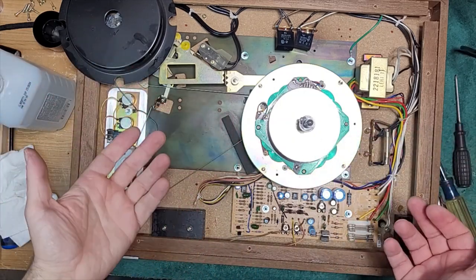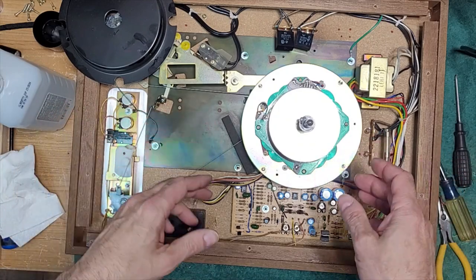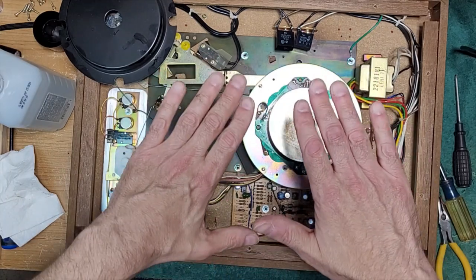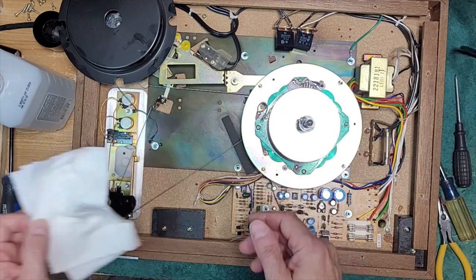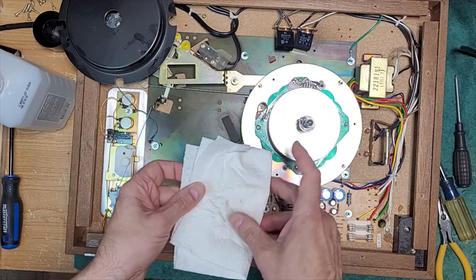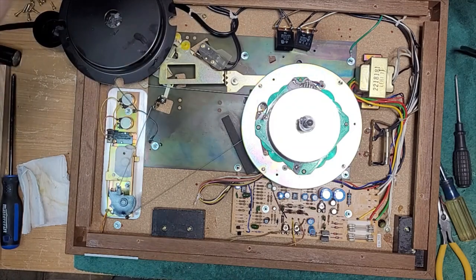That'd be ridiculous. But let's say you put in seven drops and it's really struggling to go down, just let it take its time. The oil will push the air out of the pit. And if there's any oil that's leaked out, just get a paper towel, lift this up again, and sop it up with a paper towel. So don't worry about over lubrication on a bearing.